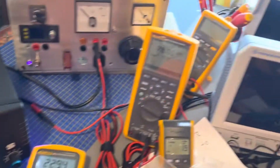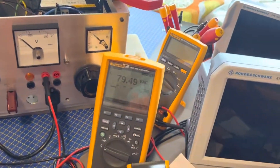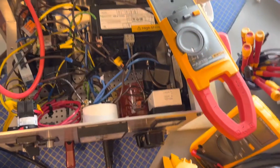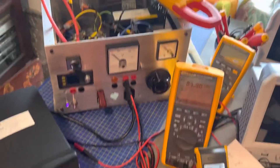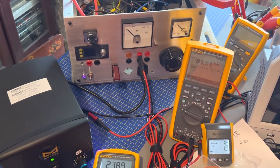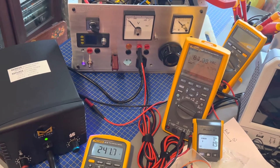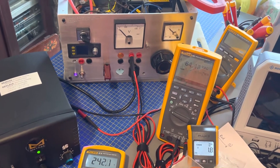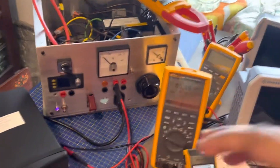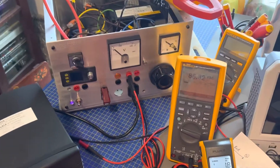I don't want to push it too far because the max current on the Variac — that brown big thing there — is rated for 2 amps output, and I don't want to exceed that. The way I set this up is I first plugged in a single bulb and tuned the voltage to 110V.